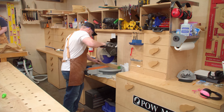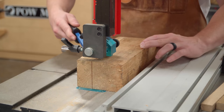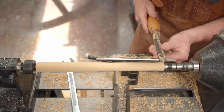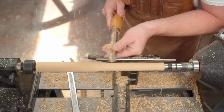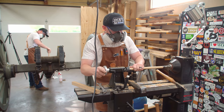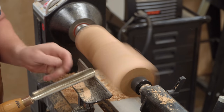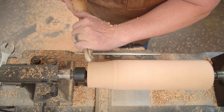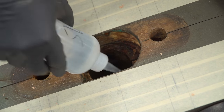The main construction wood for these carriages is white oak, so that's what I'm going to use to plug the holes. First up is to cut some turning blanks, then the dowels can be turned, starting with the smaller dowels. I used an open-ended wrench as a guide to get the dowel to a uniform size, and then reduced the diameter little by little to sneak up on a very snug fit, checking it between each reduction. After the small dowels, the larger dowel is turned round and then one end is reduced for testing, and with a test fit confirmed the rest of the dowel is turned to that diameter.